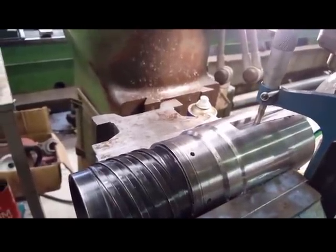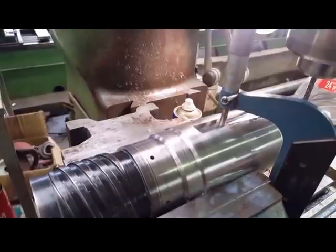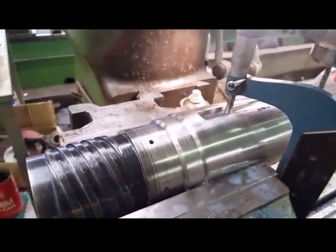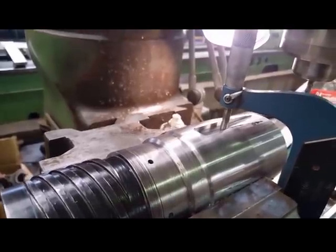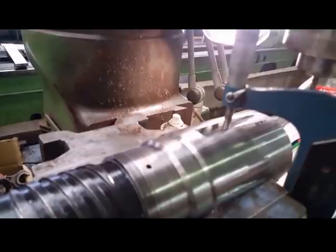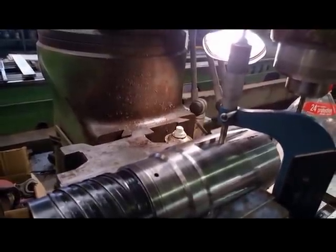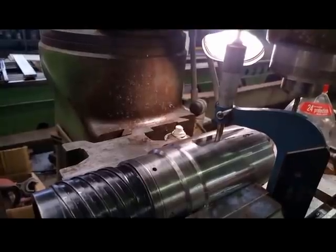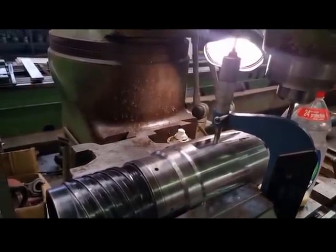I've got 6/1000ths of an inch deeper to go with this pocket. I just want to tell you something quite important with these bridge bores, or any mill for that matter. Don't adjust that lock, and don't adjust that lock. They can either lift or drop the table, maybe only 1/1000 or 2/1000, but that's too much for tools like this. They need to be zero dead. They can't be +1/1000 or -1/1000. They have to be zero. So do not adjust the locks.